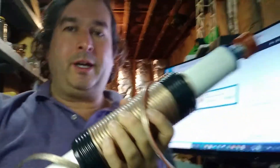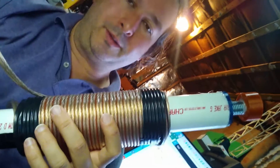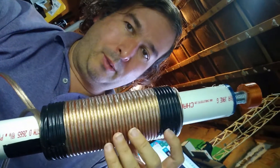Hi. I want to send a special thanks out to Jack for pointing out that I really should have wound the inductor on the lower part down here. Because what happened — if I leave the inductor up here, I was thinking, well, if I turn it clockwise, it will increase the frequency, that's true, and it'll make it a little bit more convenient. But there's a steel rod here, and that's going to add inductance to this middle part. So I'm just replacing the big ferrite inductor with a smaller one.